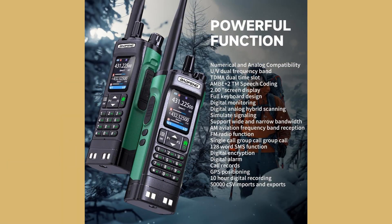Now let's focus on the differences. The major difference between the UV-32 and the DM-32 is that the DM-32 has the capability to use the DMR digital mode. That means on the inside, the radio is completely different. One of the reasons why DMR radios have such a high channel capacity is that each talk group you program requires a channel for your hotspot and each different repeater you plan on accessing.